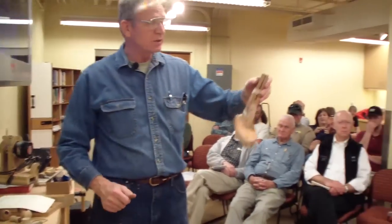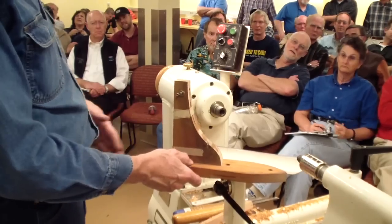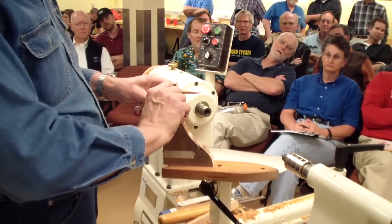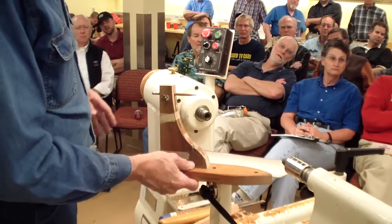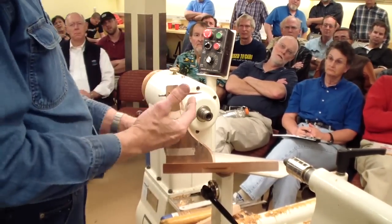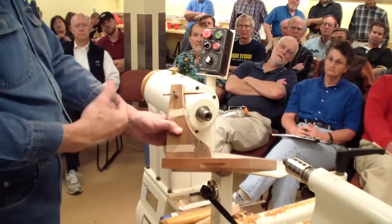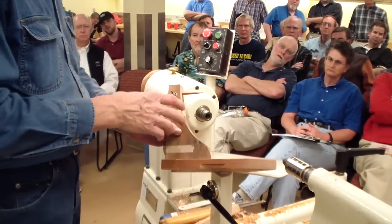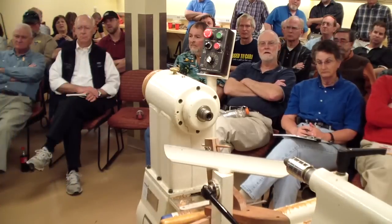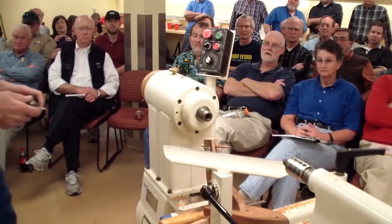If you're going to lay out and cut your own, you need to make one of these. This fits a 16-inch lathe. And in Cincinnati, the guy was telling me that this, I shouldn't tell people this at all because it's really difficult to get this hole at exactly the correct height when you screw these things together. I never thought that anybody would do it that way, but he did. And I never thought to mention it because I just couldn't conceive of that.